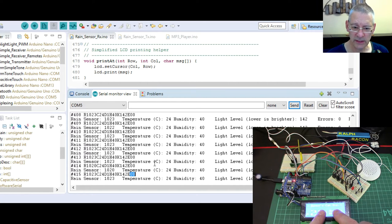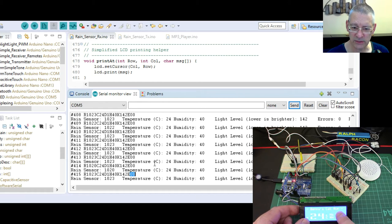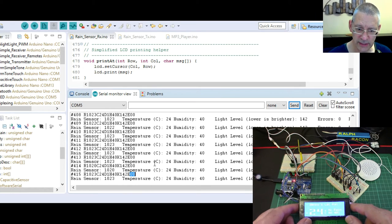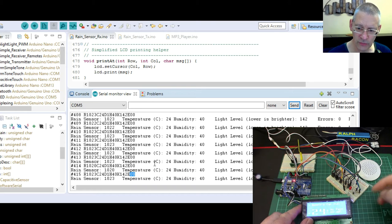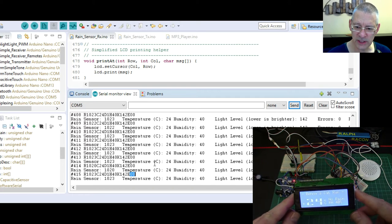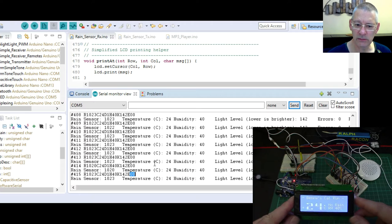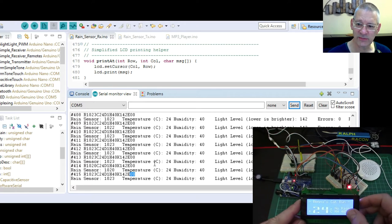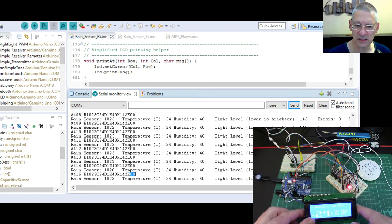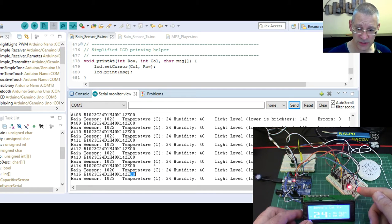The last two digits are the error bits — if there's an error it will be detected there, but I'm not doing anything with it yet. I need to detect that and display something like 'error detected' so I know something's wrong with the transmitter. The transmitter has only gone wrong once since I plugged it in — it's been running 24/7. I also need to implement a heartbeat so the receiver knows it's actually getting a current signal — if no signal is received for 30 seconds it should display a warning.